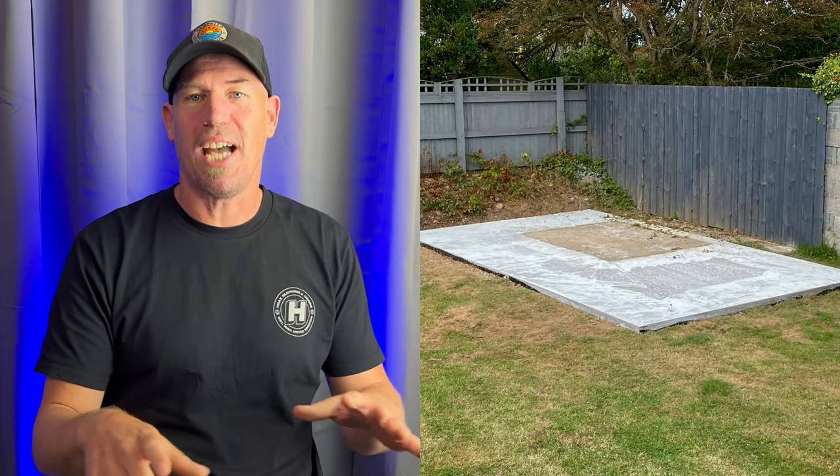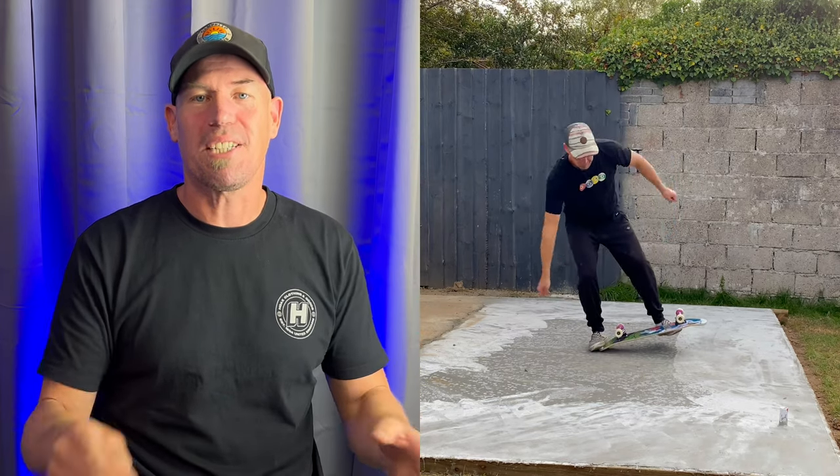I got loads of people to help with loads of barrows and protective gear — concrete is pretty nasty stuff. We started barrowing it through, getting it down as quickly as possible with only about two hours to get it all in. It was then a case of smoothing it off with a bit of two-by-four laid across that timber frame. Once all the concrete was in I kept working it with a couple of different floats, and much to my surprise managed to get a pretty even finish all the way across. I kept the concrete damp for a few days so it didn't dry out too quickly.